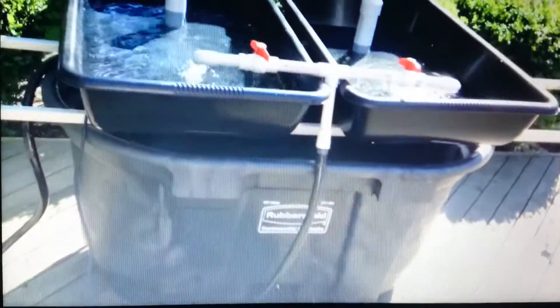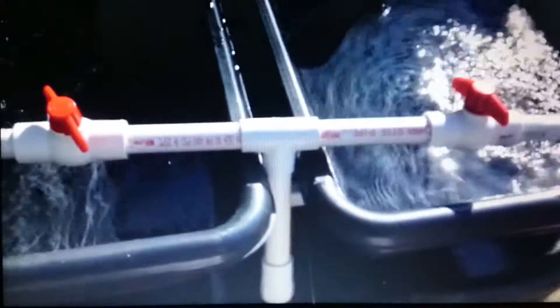Real simple — all I really have here is a 400-gallon-per-hour pump. It's coming around on this black 3/4-inch tubing to a fitting that allows me to transfer it to 3/4-inch PVC. Then I've got a T here running to two adjustable ball valves where I can adjust my inflow. Everything going in and everything going out is 3/4-inch.